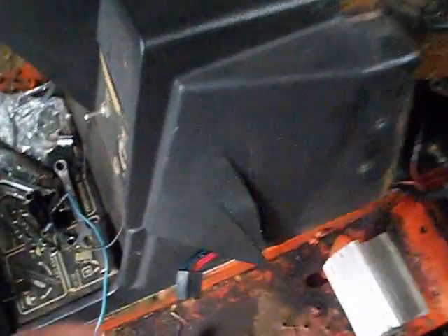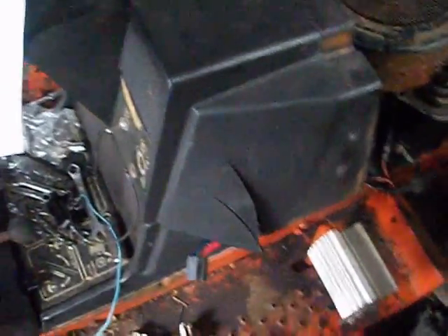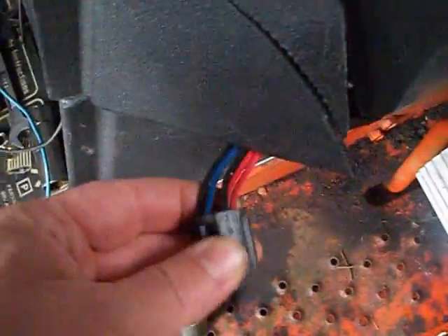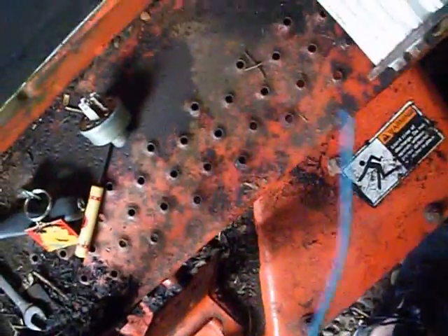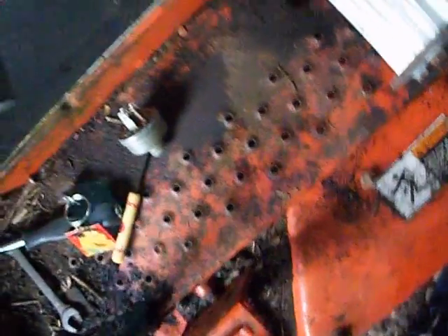January Man 169 sent over to me how I can rewire my tractor here. Basically, you just bypass the two wires that are not very good on the key switch, and hook them to the solenoid, and just hook the other wires the same. My wires have those spades on them, so I'm going to use a spade wire and hook it to the solenoid when I do it.